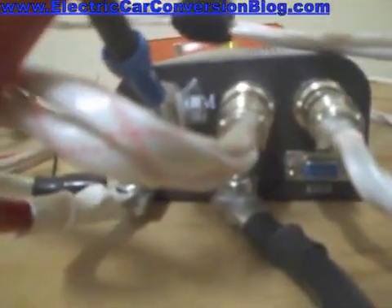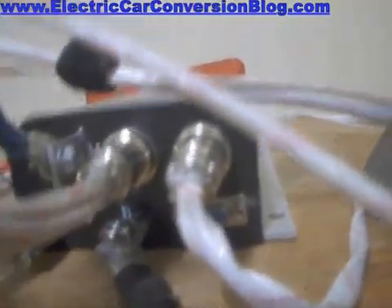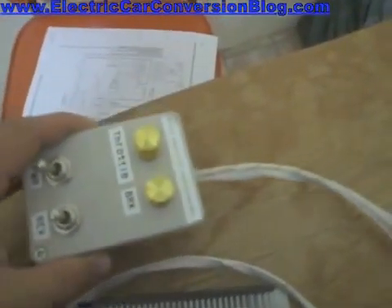Over here, going back to the main contactor, one of the terminals — you'll see a wire from there going to what's known as 3, and that eventually is part of a set of cables that leads to J1, or plug J1. Now plug J2 leads to this connection, which is the control box as well.